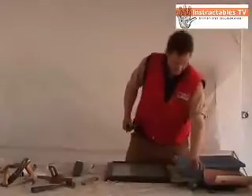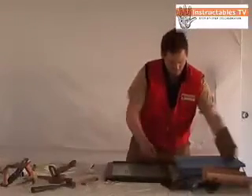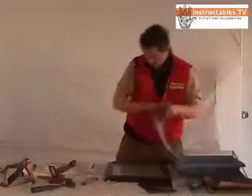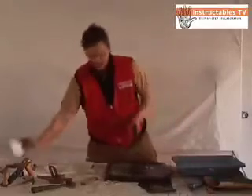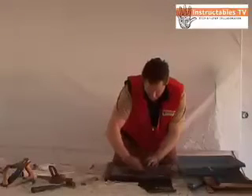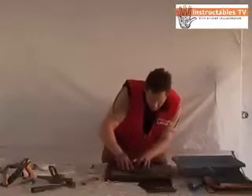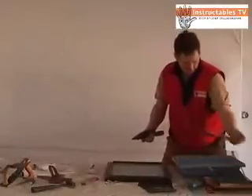So the way you make a strong edge — and this is how they do it all over the world — you take a piece of glass and various coarsenesses of sandpaper. We'll start with 320 here. Get it wet; being wet helps it float the stuff off. You look at your edge, you see what angle it's at — that's the angle. You can also just look at it and see what part's getting shiny. You want to just be hitting it. And then once you're satisfied with that, you raise the angle just enough and you shave — you're shaving the top level off the sandpaper. You do most of your work on your coarsest grit, then you move up to your 400.